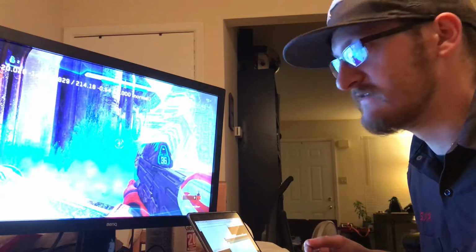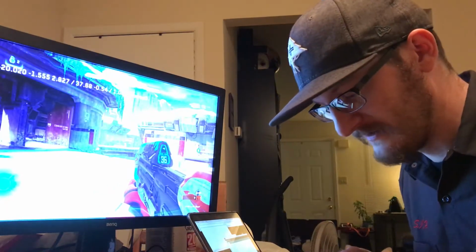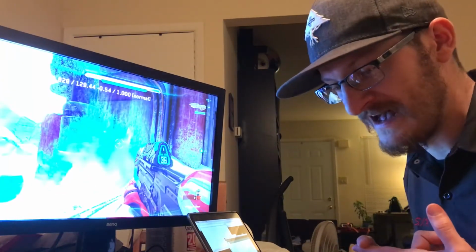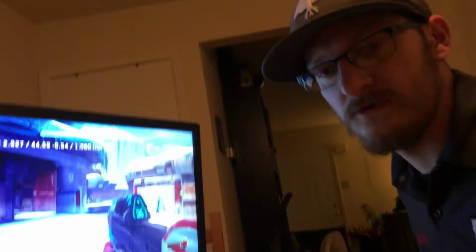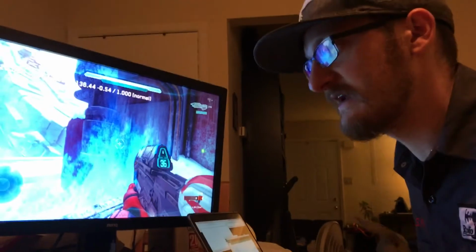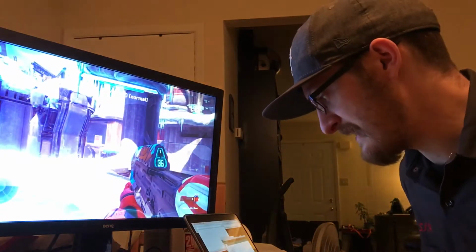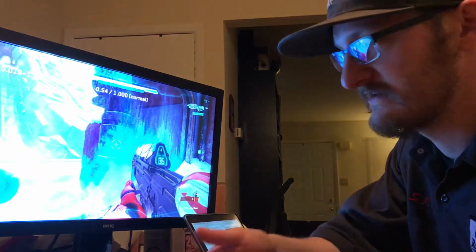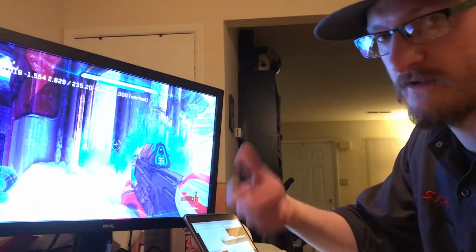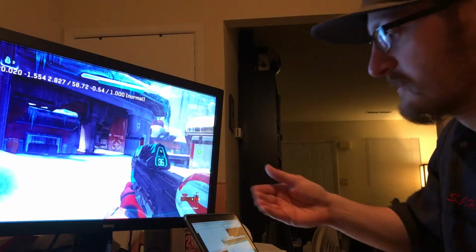But it turns out that the delay code for the Arduino is extremely inefficient. It was a combination of the delay as well as the call to write out to power this pin here. If I zoom in, pin number 13. So I'm now writing to the pin to get power out to the relay in a lower level manner, as well as using a different way. Rather than telling the system to delay for a certain amount of milliseconds, I'm accumulating time and counting milliseconds myself, and when it hits a certain point, either starting or stopping the turning process.